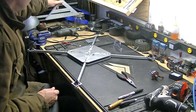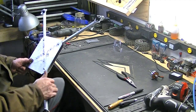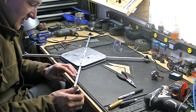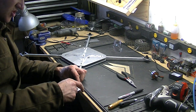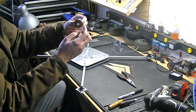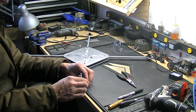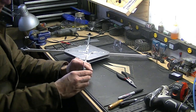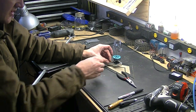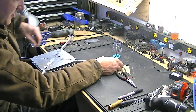As you can see, I got all the plates on and the little motor mount brackets mounted. The motors pull off the mounts — there are just two set screws that hold them in, so that makes it easier to locate the holes. It's on there nice and tight. I may take these sharp points off. Here's the actual brushless motor — it spins on this shaft and just fits down in like that, then two set screws hold it in. I can clock it exactly where I need to so the wires run down right on top of the arm to the speed controllers, which I'll mount somewhere in here so they get prop wash to keep cool.